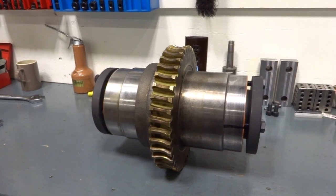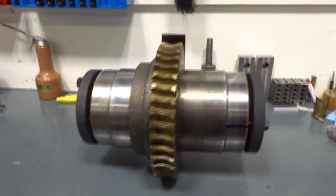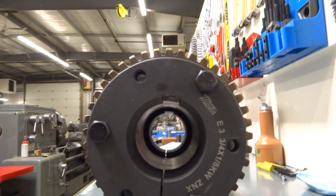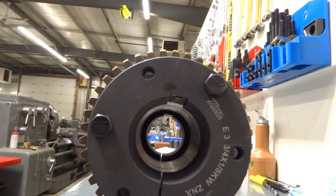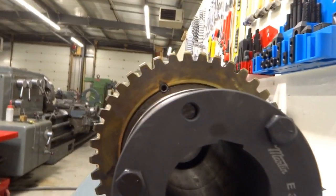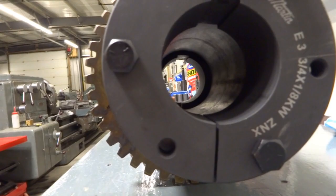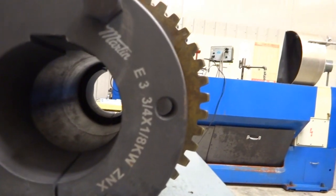The shaft is now completed. I put the taper locks in the end just to confirm the holes are in the right spot. You can see both keyways line up and the bolts are in the bolt holes. The jacking screws are not over top of the old bolt holes, so everything lines up. All the bolts have a new hole in good solid material to go into, and the jacking screws have a good surface to push against.